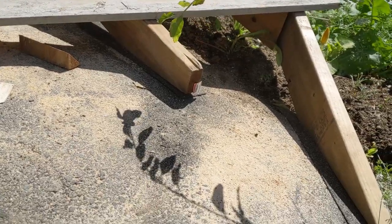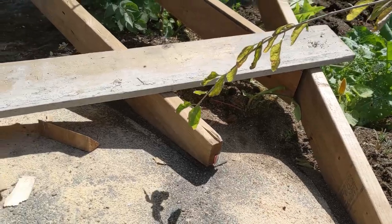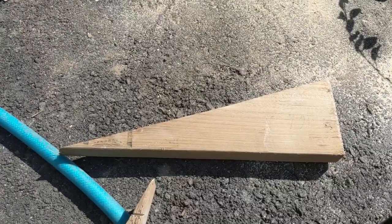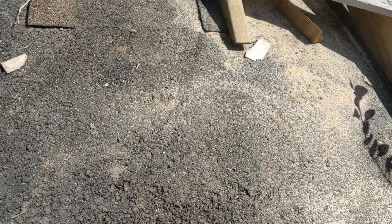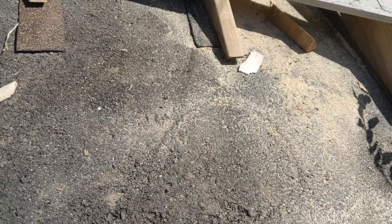Some of the joists look a little bit short in there just because I just had 16-foot long, but I can use one of these leftover pieces just to complete it - that way you have support beside all these joists. I'm gonna cut this shingle straight to it and put some asphalt just to keep it in place, that way they don't move.